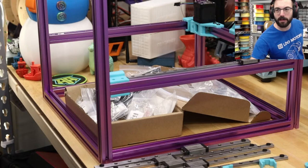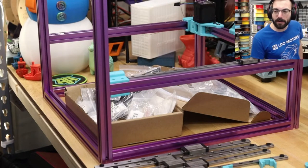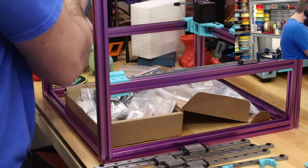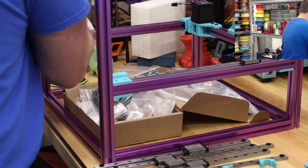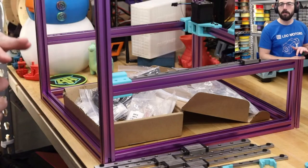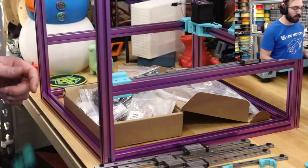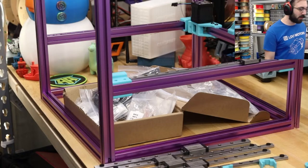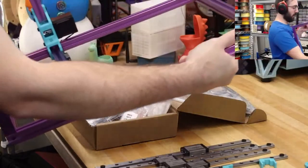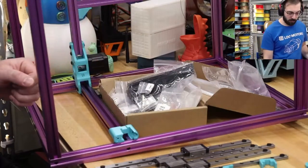Let's hide this for a second because it's blocking my face. Your 350 isn't quite big enough. Not big enough. Yeah, I can sort of see where you're coming from. In fact, I would skip right to something like, Hevort has a 410 size. So it might be worth skipping from a 300 with the 6mm AB belts and going right to a 400 with a 9mm belt. That could be something to look into.